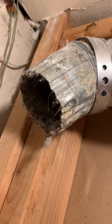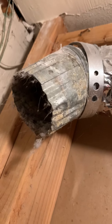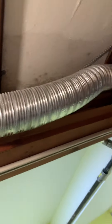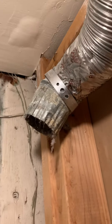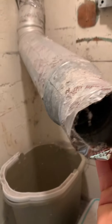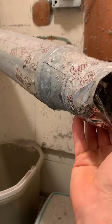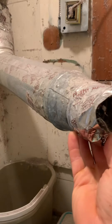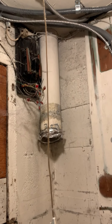This is a three inch pipe. So it goes from a four inch down to a three inch, and you do not want to do that because this reduces the flow of air from the dryer — it restricts the airflow out of the dryer. Then it goes into this mess. You can see they had an adapter here to go from three inch to the four inch. So we're going to get rid of all that and connect back up and get it going back outside.